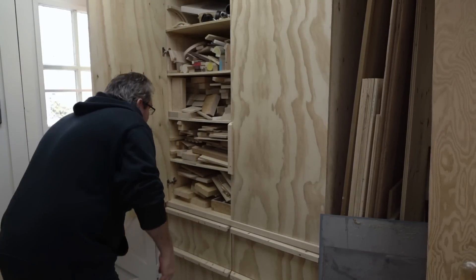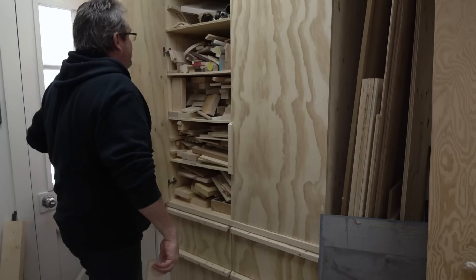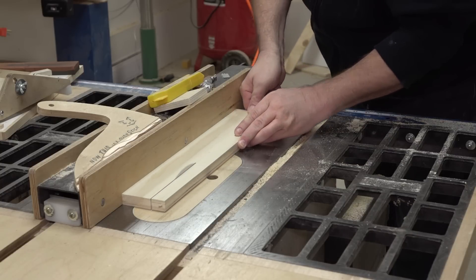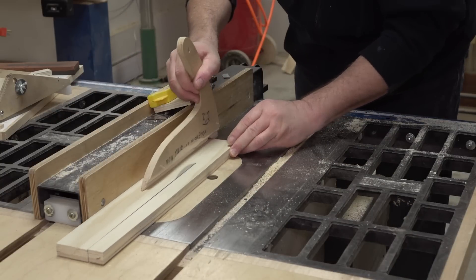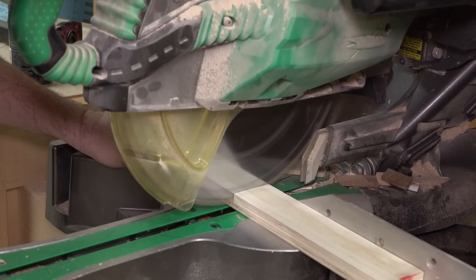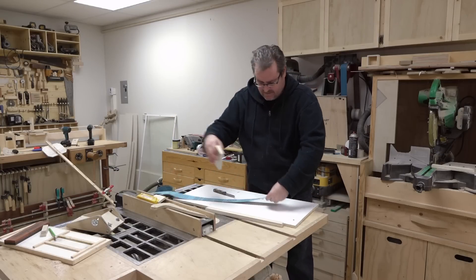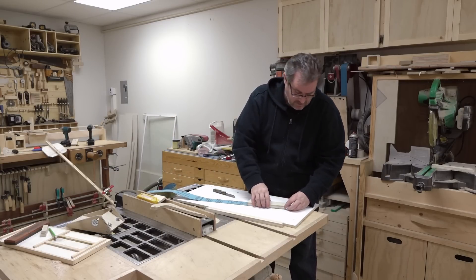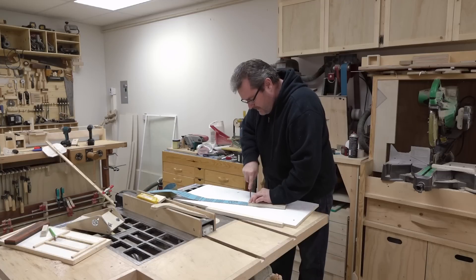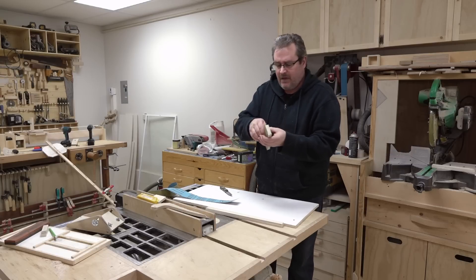The first thing I need to do is get a piece of plywood that's the same thickness as the stone I'm using. If you don't have a stone you can start with any thickness plywood, although half inch and above is recommended just to make sure it stays flat. Then I'm going to cut it to two inches wide and cut it to the right length to fit in my jig. I've got the plywood cut to length and I'm going to use that to cut the sanding belt to the right length — just line it up on the end and make a cut across with my knife.